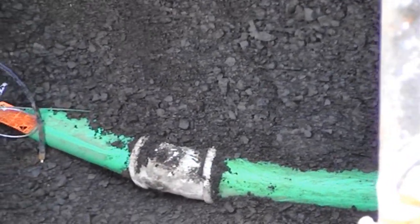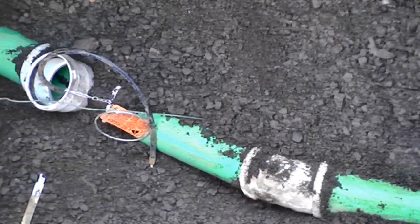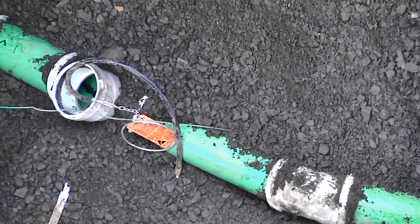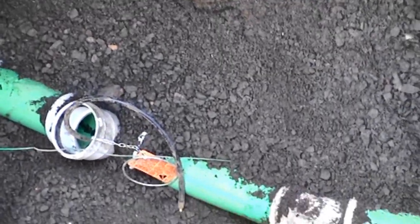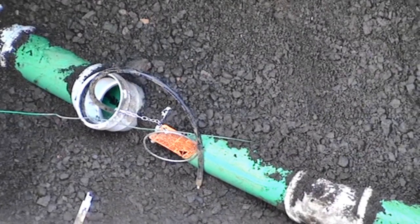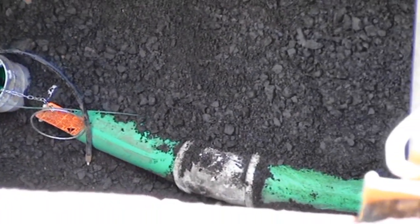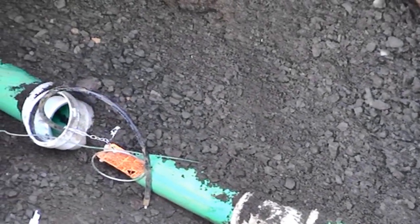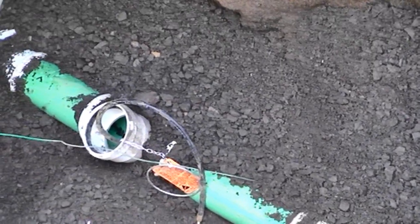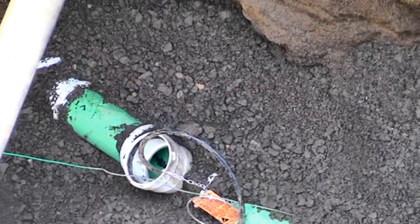So because they're two different types of pipe using two different types of joints, the Fernco coupling is the acceptable joining method. Looking further down, we can see a tee with a test ball in it. That test ball will be pulled and deflated to let the water out, and then we'll video the HDPE line to check if there's any water locked in the pipe, any bellies, and to make sure it has uniform slope.